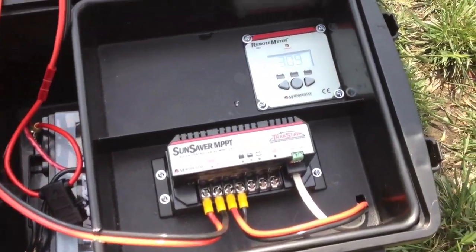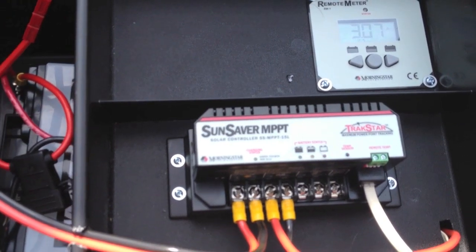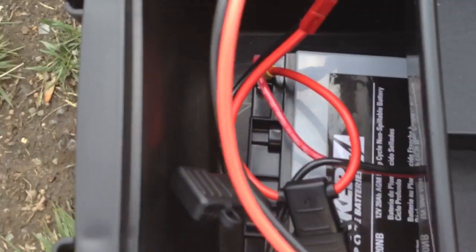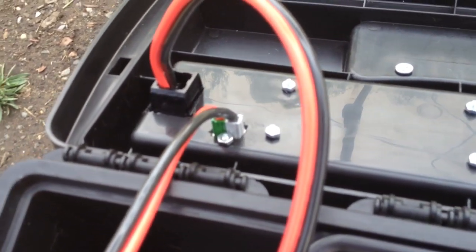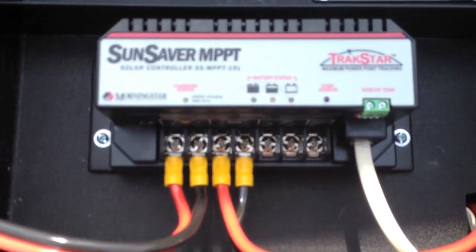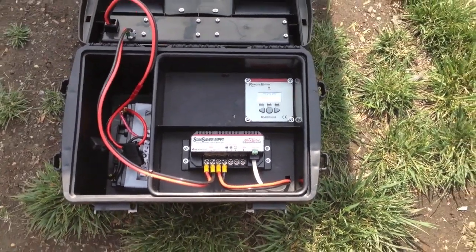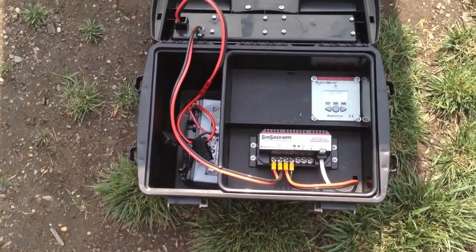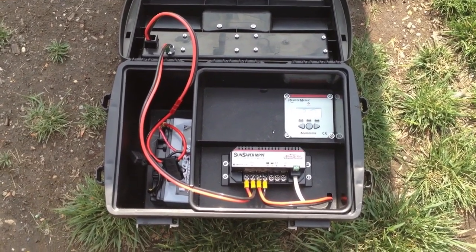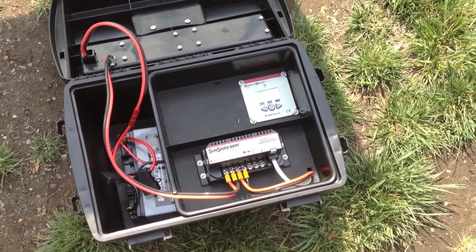Let's take a look inside. Here's the interior of the box — right now it's pretty spartan. What I have here is a Morningstar Sun Saver maximum power point tracking charge controller. The left two connections are to the panel and I have them running up to the green and gray power pole connections on the box. The middle two go to the battery, which I'll show you down below. The two to the right are made to attach a load. The reason I'm not using that function right now is this thing is only rated for 15 amps, and my HF transceivers can draw up to 22 amps at 100 watts for something like CW or FM — which the batteries can handle but the charge controller could not. So I had to bypass that, which is kind of a shame.